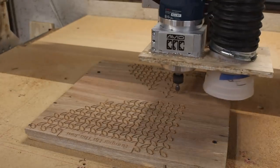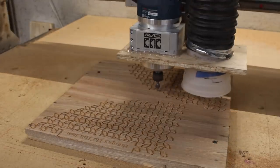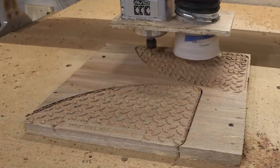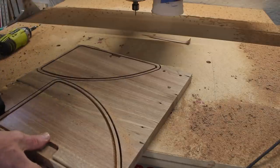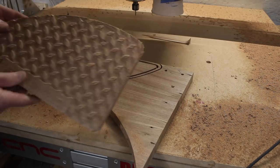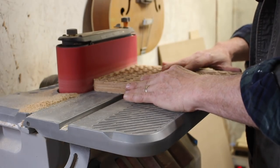I flipped the work over and started to carve my diamond pattern. You can see I'm doing the V-bit first, carving that profile edge that gives a slight chamfer to all of the diamond shapes. Then I used that eighth-inch end mill to clean up all the negative space in between. I used the same end mill to cut the piece out — cutting halfway from the top and halfway from the bottom with a few tabs. Then it was just a matter of cutting the tabs, taking it out, and sanding down the edges.